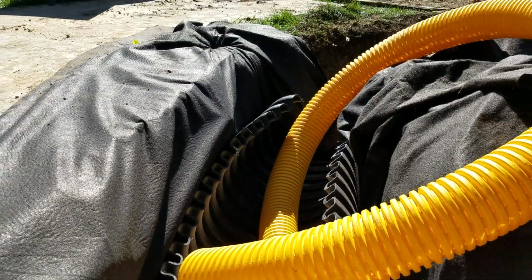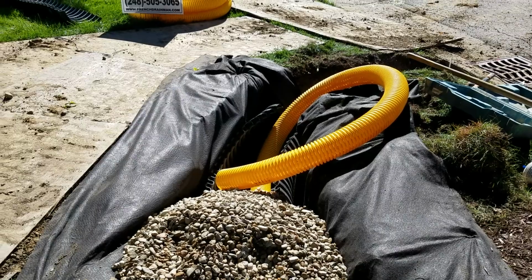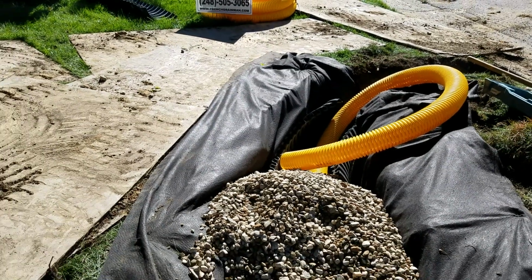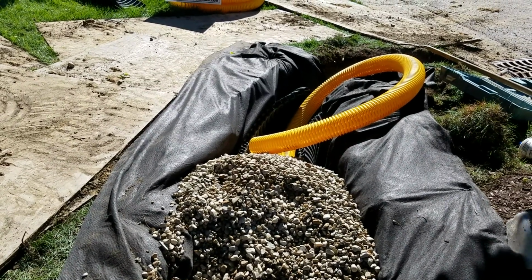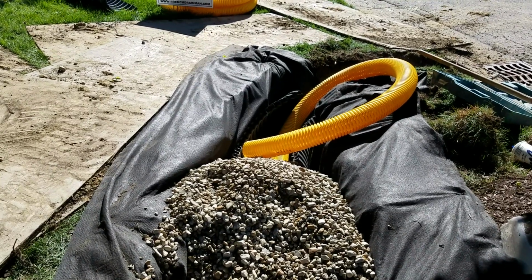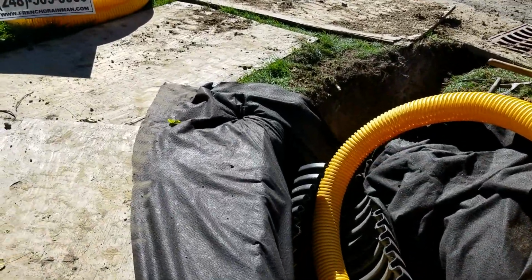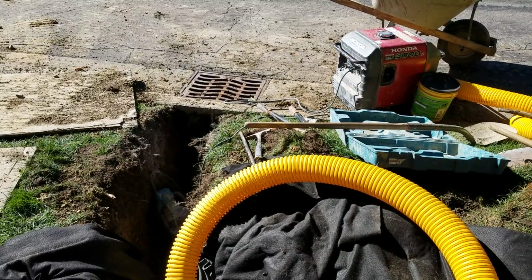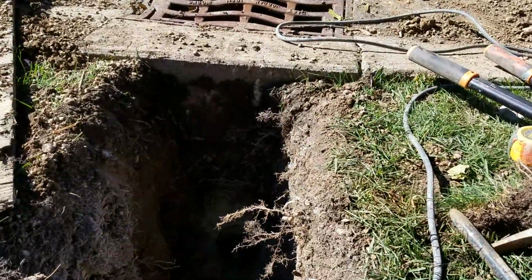we put a trench liner in here. We're trying to throw everything at it that we can to protect the drainage system from this tree. The trees are a Freedom Drain or French drain's kryptonite. This system here would last to the end of time if it wasn't for that tree. However, I want to build this system to where I know the homeowner is going to get 20, 30 years out of this system before that tree compromises the system. I want to be dead and gone before this system quits working. And that's the plan. Build it to last. I can't do a thing about the tree being there, but I can build a system to where we buy these homeowners 20, 30 years.